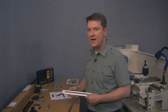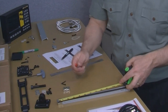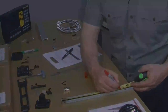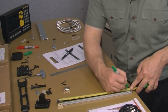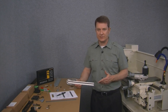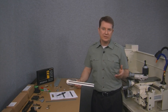The shortest we want to cut the scale is X-Min, which we calculated to be 10½ inches — let's mark that in red. The longest we want the scale, X-Max, is 12⅝ inches — let's mark that in green. Anywhere between the two marks is fine, but DROPROs always recommends cutting longer over cutting shorter. Remember, you can always cut it again if it's too long, but if you cut it too short, you can't make it any longer.